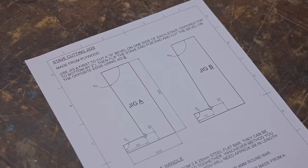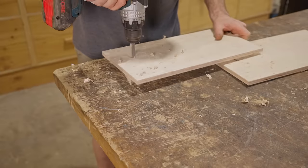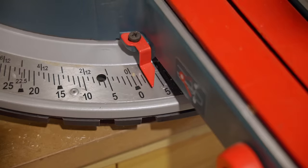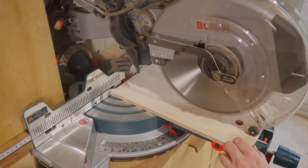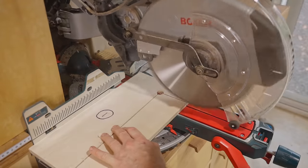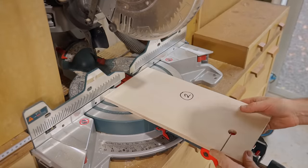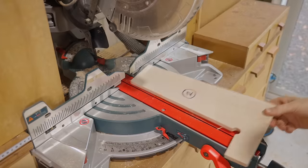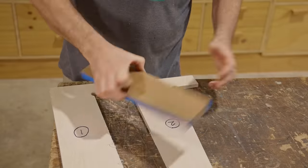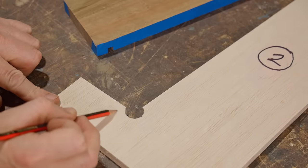I've put the dimensions for the jigs in the free plans, which you can download from a link in the description. The jigs are made from two pieces of plywood and used on the table saw. You could just use a tapering jig, but these angles get pretty confusing and it'd be easy to make mistakes — so if you use these jigs you really can't go wrong. All of the pieces will be pushed through the table saw with jig one first, then flipped around and cut the opposite bevel on jig two. I cut the angle of one section the wrong way but it would still work fine — it's easy enough to re-cut it.